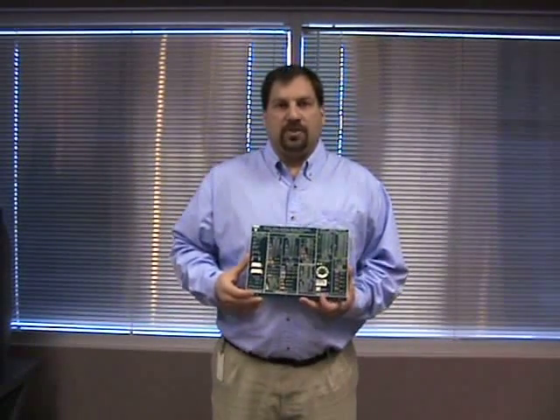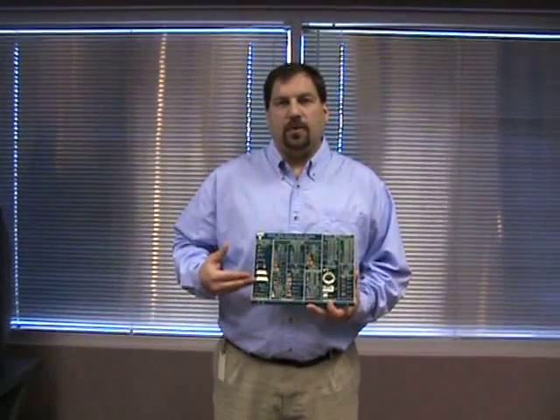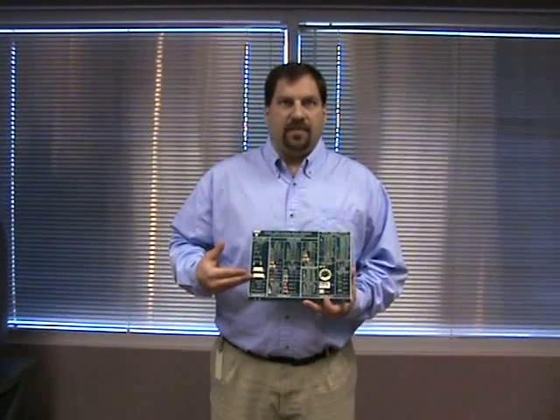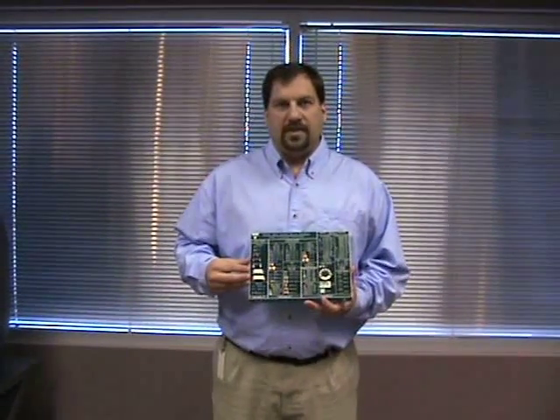Hello, I'm James Reba, Product Marketing Manager with the Vishay Dale Wire-Wound Resistor Group. For my high-power surface-mount resistors on the left side of the board, when discussing opportunities with customers, you'll want to find applications that have requirements for short energy pulses, such as a capacitive discharge, or if they have harsh environmental conditions, such as ambient temperatures above 150 degrees Celsius.